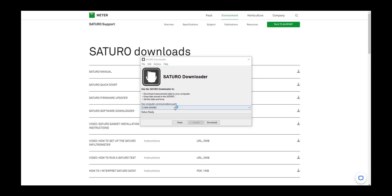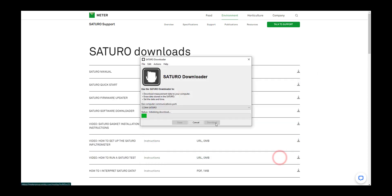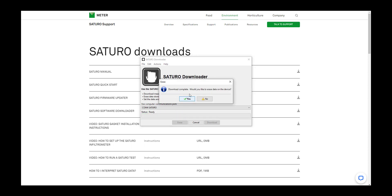It's very simple. You need to make sure that this is connected to your Saturo. My control unit is connected through the USB port into my computer. Once it's connected and you are on COM4 Saturo, then you can click download. It will ask you where you want the file downloaded — I want it on my desktop. I select this folder and automatically it will download and show it to me. After it's done, it asks you if you want to remove the data from Saturo memory or not. The good practice is to remove it every time, but right now I'm going to say no to make sure the quality of the data is good.